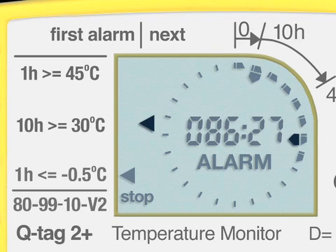The second alarm happened during the seventh 10-hour period of the journey, indicated with an additional arrow next to the seventh dark segment pointing to the middle. The type of this second alarm is shown with a limit indicator indented under the next sign, pointing to 30°C for at least 10 hours cumulatively. If there is a third alarm, it will be shown under the next sign, but from the screen it will not be possible to tell which is the second and which is the third alarm.